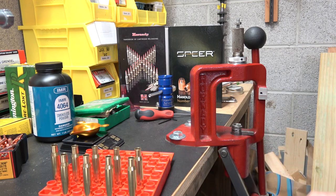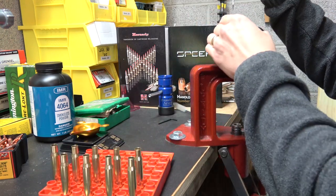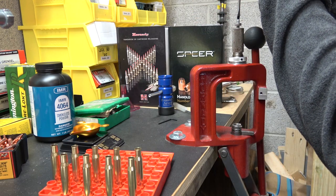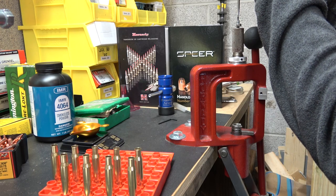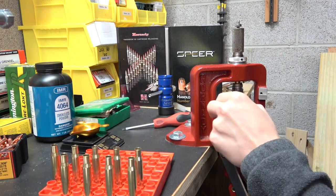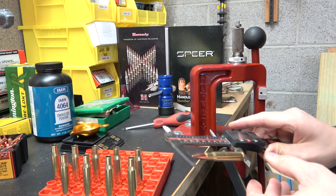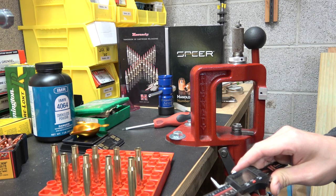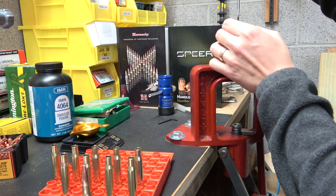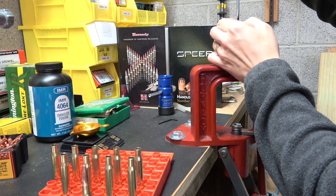At 3.408 after 5 turns — math was correct, showing we need about 5 more turns. I'm going to give it 4 more turns just in case I miscounted by half a turn and don't seat too deep. 1, 2, 3, 4 — reading 3.262. So we do need about one more turn.